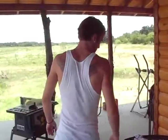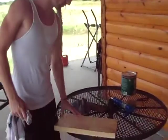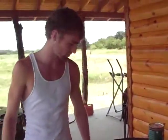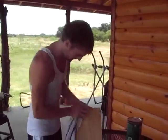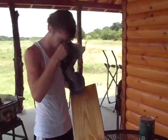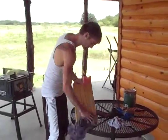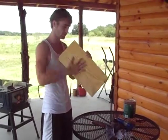Third step — we get a wash rag. We get a wet wash rag and a dry wash rag. You have a lot of loose debris on here now from sanding it and making everything loose. When you paint that, it's going to cause the paint to run really bad. Plus it ruins the whole point of sanding because it's going to leave bumps of paint everywhere. So you're going to get this wet wash rag and wash all that off. Then get your dry wash rag because you don't want the board to be wet when you paint. Dry everything off. So now you have a smooth board, the cracks fixed, it's not rough, and it's all clean.